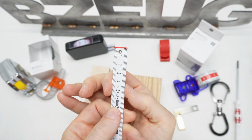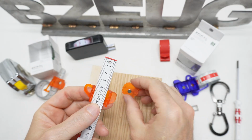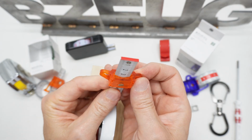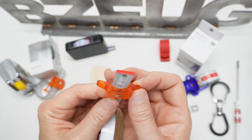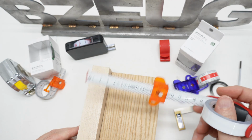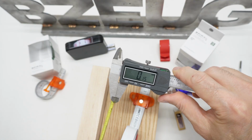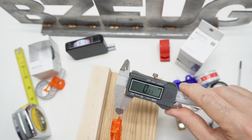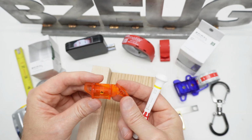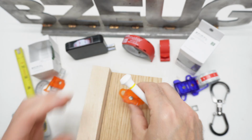This tape is narrower, but it's thicker than the Stanley. So these clips can be used on smaller tape measures as long as they've got a decent thickness. Then you can do this whole idea of getting instant readings and transferring that. So it's 0.15 millimeters thick on the Stanley, and the BMI is 0.19, almost 0.2. So if you have any brilliant ideas for the use of these clips on any other tape measures, please do comment.